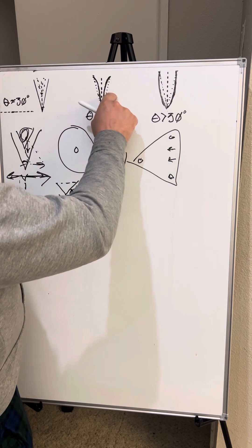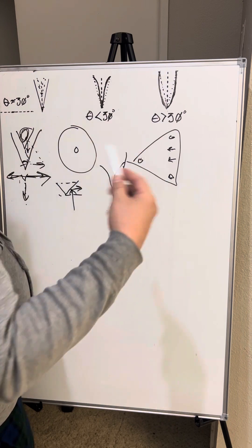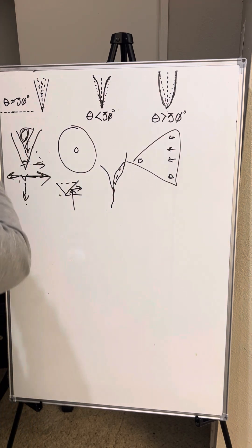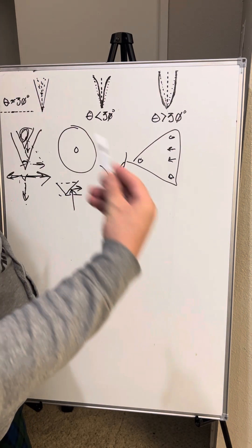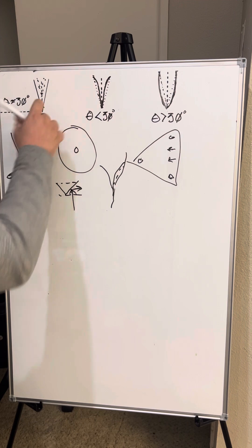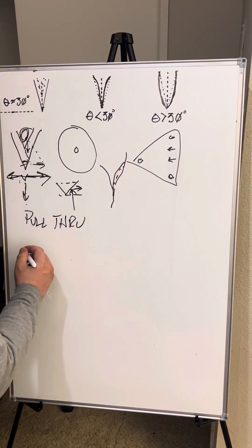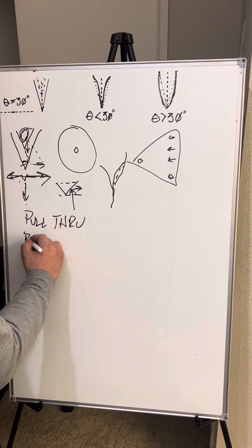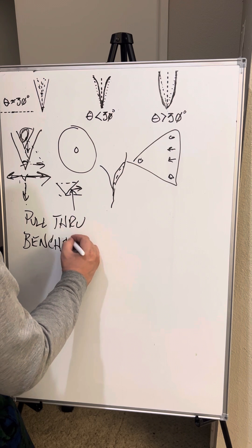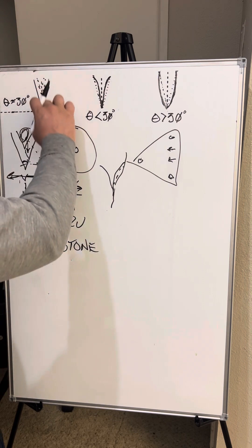We're not going to spend too much time on hollow grinding by hand. The series is mostly going to be about hand sharpening as well as some different types of sharpeners. It's really going to be about how you can do it at home by hand. Flat-side edges tend to come from pull-through sharpeners, and bench stones generally give you a flat grind if you do standard technique.